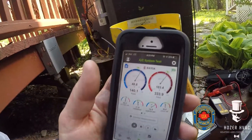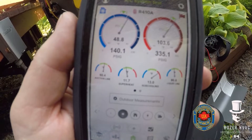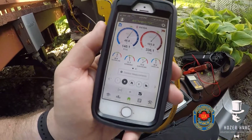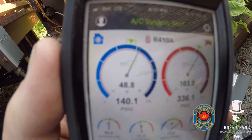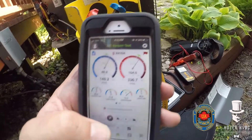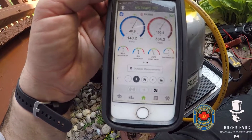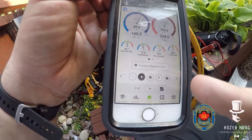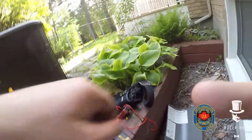Alright, so it's coming down. Pulled about a pound, two ounces out — still dropping. Head pressure's looking a little okay. I haven't been inside to update my low side. All I care about right now is getting that sub cooling down. My approach on this is zero — that's funny. When your approach is too low like that, you want to pull out. It means you're overcharged.